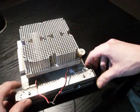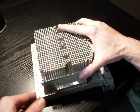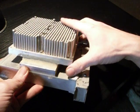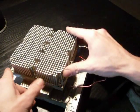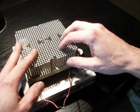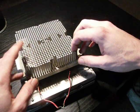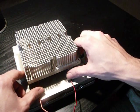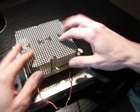This thing is pretty old — 13 to 14 years old — but hopefully it gives people an idea of heat sink size and mass when you get into thermoelectrics. This was set up active. If it were passive with no fans, it would only be able to do about 25 to 30 watts with the same 10-degree net rise. So the fans do make a difference, but then they take power.